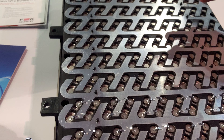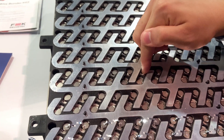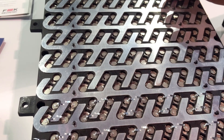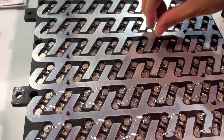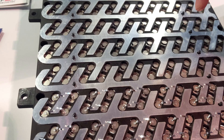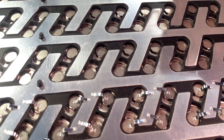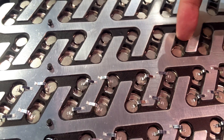During the bonding process, the bonding machine needs to go down and place the bond into the bus bar, just like that. This is done through pattern recognition that's embedded into the equipment. We need to remove the bridge here because the bonding equipment at the tip needs around 2.5 millimeters of space, and if it doesn't have that amount of space, it might short-circuit when it touches the edge of the cell.